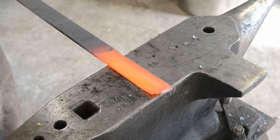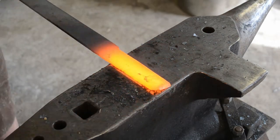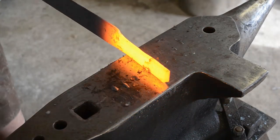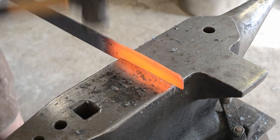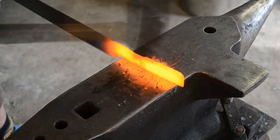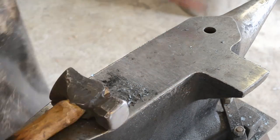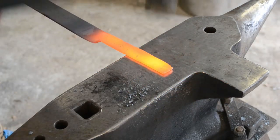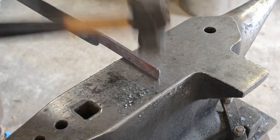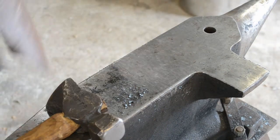With the first blade finished, we're now going to move on to the next couple of blades. And because you've already seen me forge the first one at normal speed, we're going at 5x speed through the next two. Drawing out the material, making sure that we're the right size of bar stock, drawing the point, running out the curve, drawing the bevels, then cutting it off, flipping it around to the tang, and drawing out the tapered tang to finalize the blade. And you'll see that we came out with relatively accurate results.